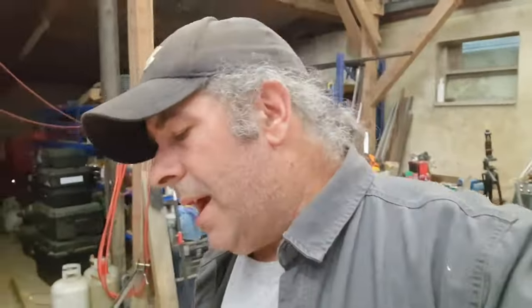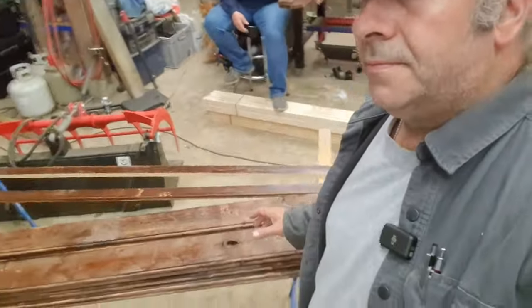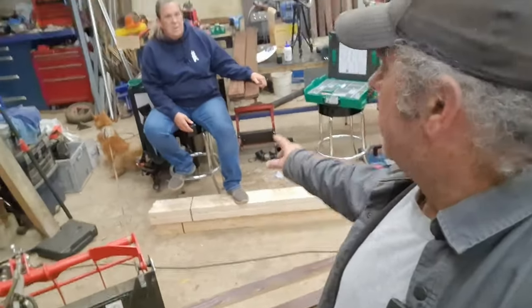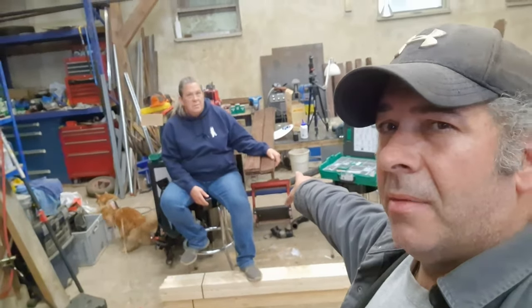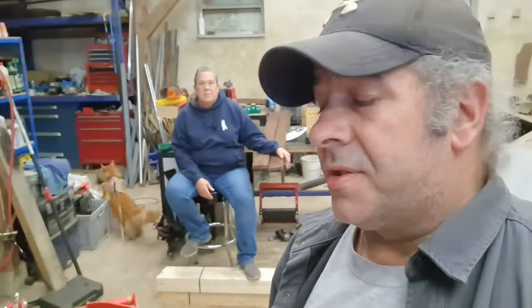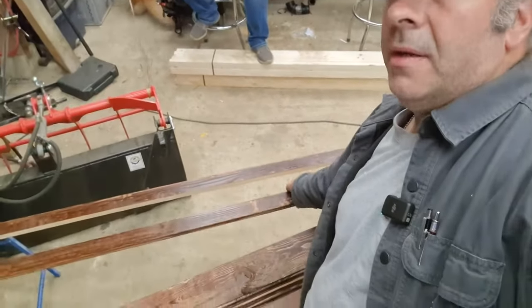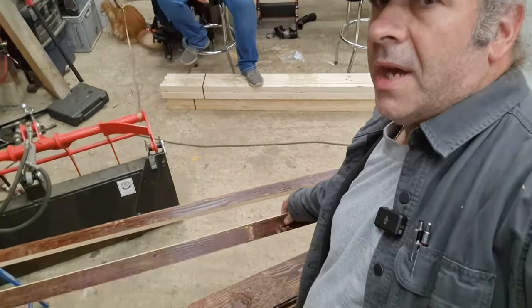All right, folks, so we have some tongue and groove pine and some other miscellaneous boards back there by Rachel. She's got her arm leaning on them. And the idea is to turn all of this into a door, a sliding barn-style door. And so we're going to have at it. You'll see I have one that's cut in half. That is so that there's no tongue or groove on either side of the door, so the easiest way is to cut that one in half.